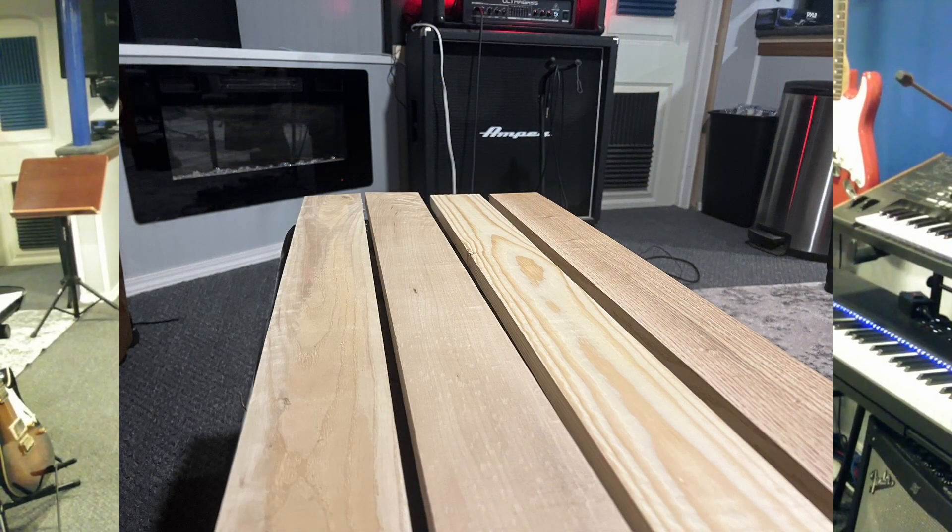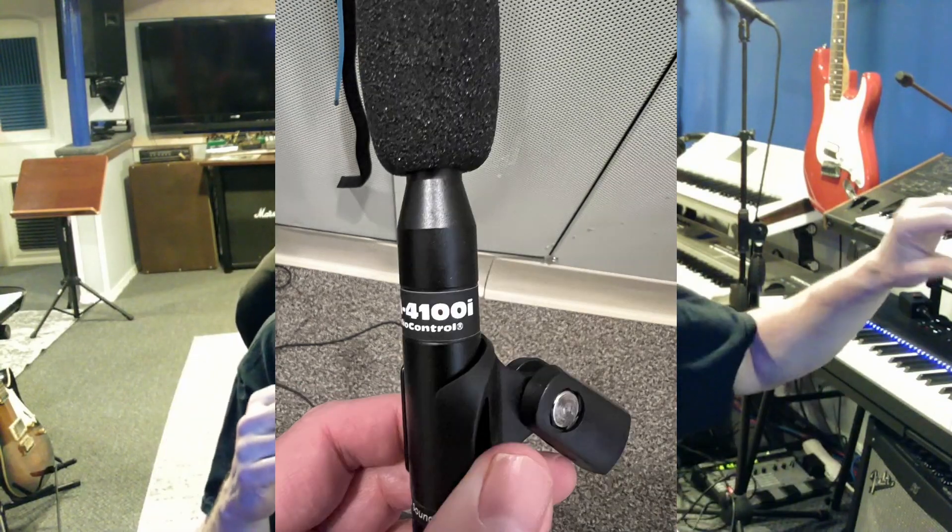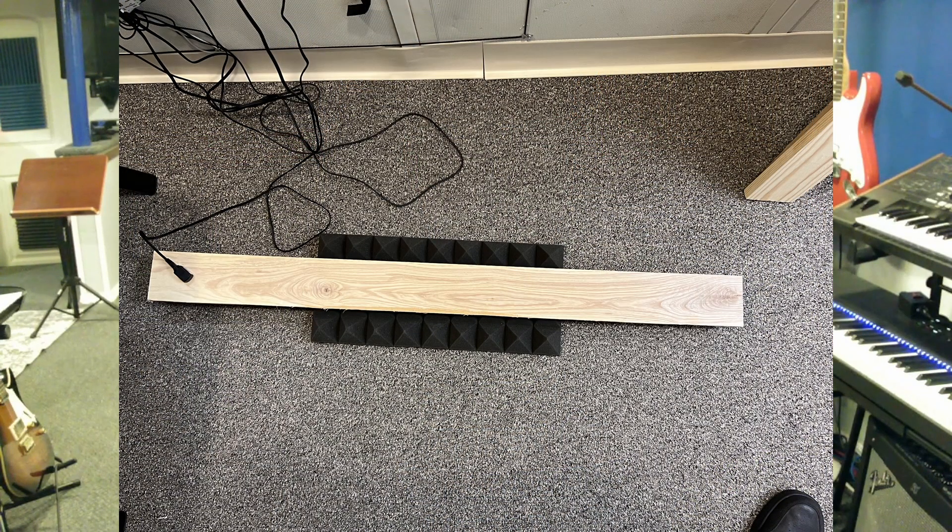Let's get to the results. Four different types of wood, all facing the exact same laboratory conditions. We applied a transducer to one end of the board, applying a pure tone sine wave at 250 hertz. On the far end of the board inside this laboratory ISO booth, which had a noise floor we recorded around 30 dB — exceptionally quiet. The best I can achieve in the quietest place in this studio is about 38 dB, so this is quite a magnitude quieter than that. We ran one of her testing microphones at the far end of the board and recorded what the wood was actually doing while being vibrated with a pure sine wave. The board was suspended up off the floor on two-inch pyramid foam so that vibration from the floor could not possibly have an impact on it.